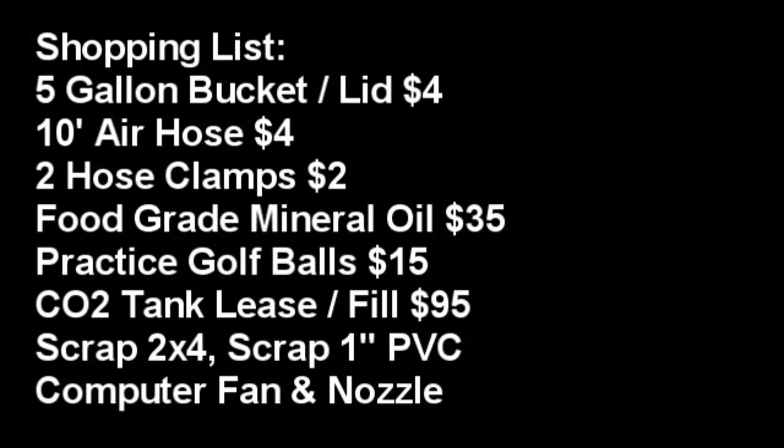I would look at possibly an air needle that goes on the end of a pump for a basketball or football. Or you could build this out of PVC pipe with a cap that has a hole in it. Essentially, you just want to force your CO2 into this bucket of liquid at a high enough pressure that it agitates and atomizes it. In testing, we accomplished this without a nozzle at all, even with a regular open hose. The smaller the nozzle and the higher the pressure, the less CO2 you're going to have to use to make your haze.